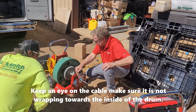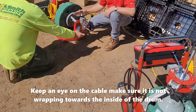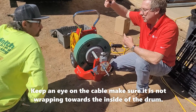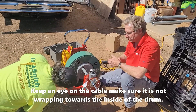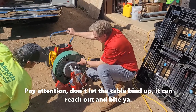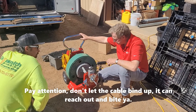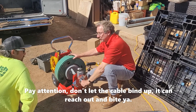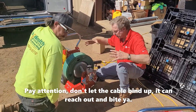What we do is we have the inner drum in the machine, and the reason why we heard that arm is it shoots the cable. When I'm loading this machine up, the cable's going against the wall of the drum and it's going up layer by layer. That's where the cable's supposed to stay — on the outside of the drum. When the cable comes to the inside of the drum, that's when you've got problems because it's going to want to shoot out. Without an inner drum, when the wire starts to collapse and go under torque, it collapses and then wants to shoot right straight out — grab you by the arm or whatever. Broke my hand.